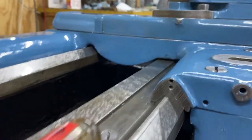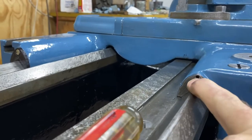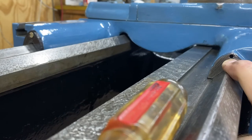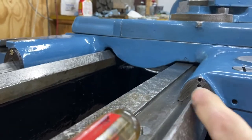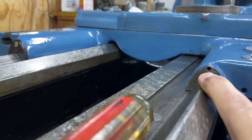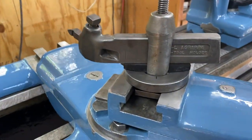The bottom hole was the primary hole and it was all full of gunk. I was putting in an 8-32 tap and because it's so close to the edge I couldn't use the tap handle, so I was carefully trying to turn it with a wrench. My hand slipped and turned it at just a little angle and I broke off a tap in there — just frustrated me. I looked and there was this indentation but not a hole. I took a pick and it seemed like it was picking out, then took a small drill and went in. It looked like someone had drilled these holes, tapped them, then decided that wasn't right and filled it with what felt like lead — a really soft metal, maybe solder. I went ahead and took all that lead out and ran the tap in again — the threads were already there — so I'm having to use the top holes on all of these because of that one broken tap. I hate breaking taps.